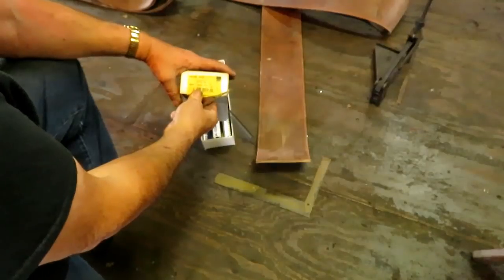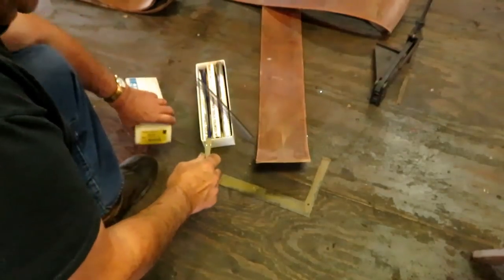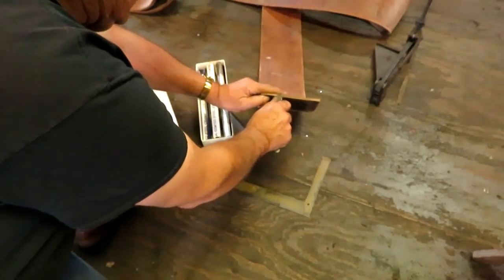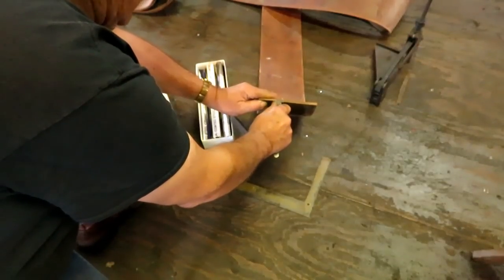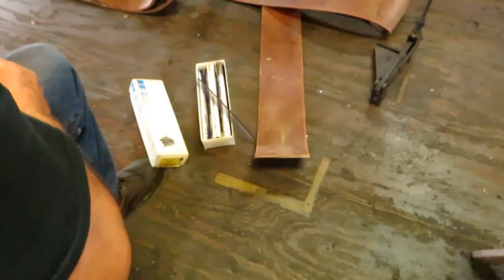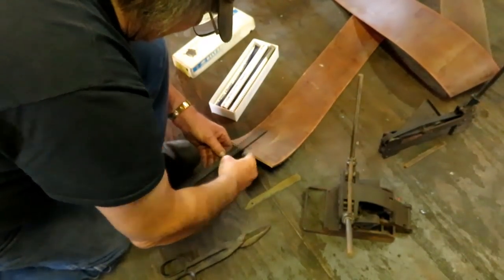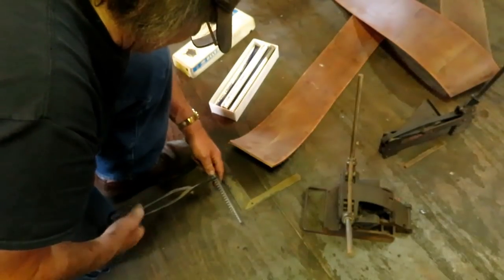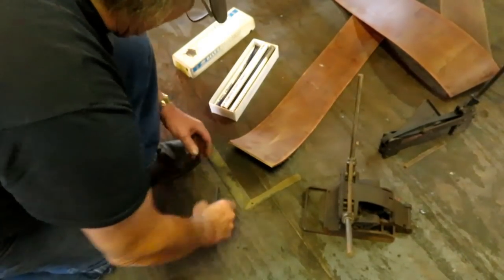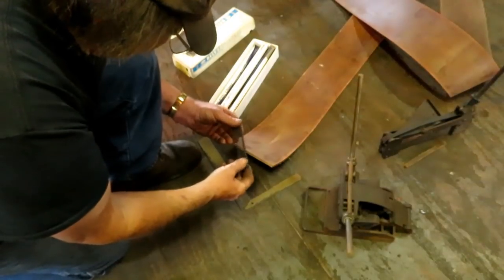These are the U4C12 clippers, 11/32 through 1/4 inch, and this, when I got it cut, measures 9/32. So we're in the range for that style. I like these unibar laces because they got this extra little piece of wire that's spot welded to hold everything together, and you don't got to mess around with the paper.